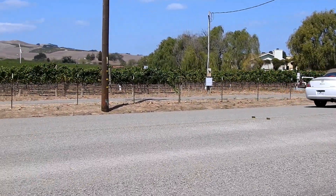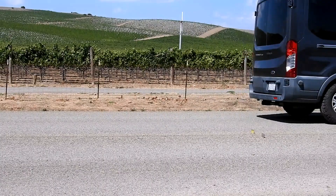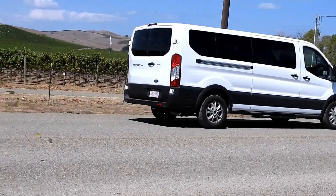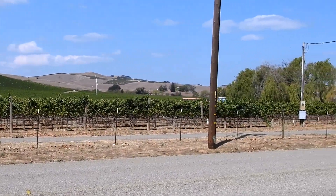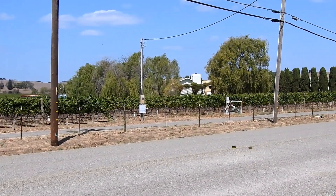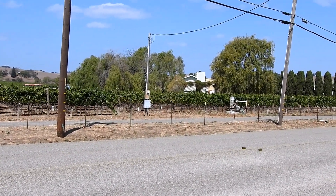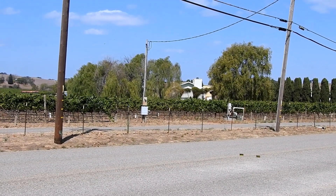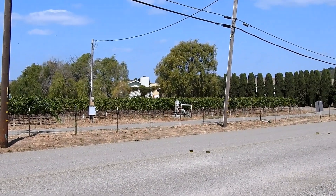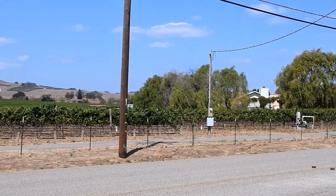I asked him about the style of repair they were doing, and if he had unlimited funding to do the job the right way — which I explained would have been the removal of all the asphalt, proper compaction of the roadbed with gravel, correcting any bumps and undermining in the surface, and then going back with a brand new surface. In fact, I recommended a 12-inch thick concrete slab, like it's done in the mountains on the way over the Sierra Nevadas into the Lake Tahoe and Reno area.